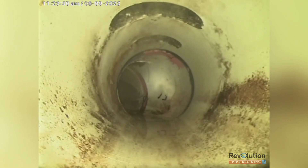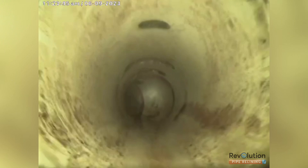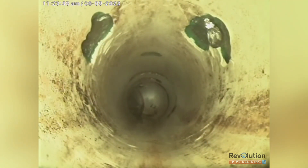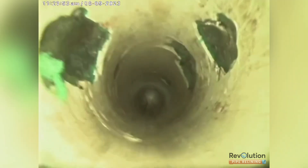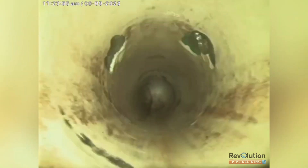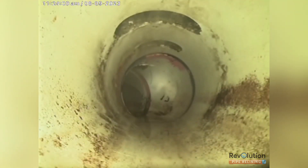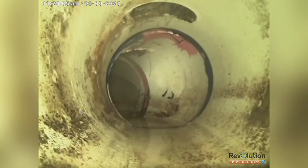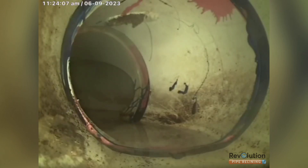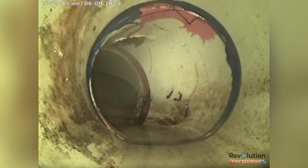Now that we've got the pipe cleaned, we can see that there are actually multiple spots — a bar through there, a bar through there, and a bar through there. There are more areas: in the roof just there a bar's gone through, and at the top there's another spot where they drilled but then pulled the bar out, leaving a hole through the pipe, plus another spot and another spot. We can probably patch to here, but the other part will require a junction patch to seal that hole in the roof.